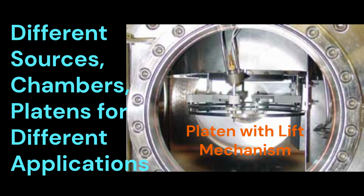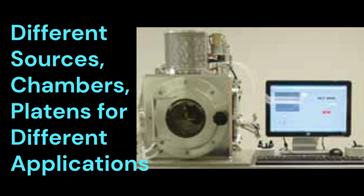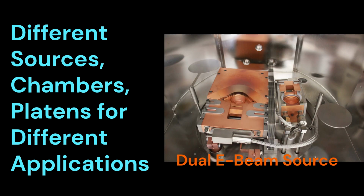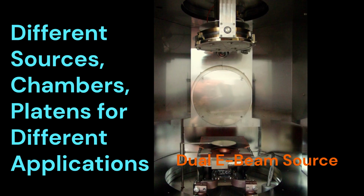Features: electro-polished 14-inch cubical or 21 inches by 21 inches by 22 inches 304 LSS chamber. 5x10^-7 torr base pressure attained with turbomolecular pumping package. 4x15 cubic centimeters pocket gun. Source and substrate shutters. 6 kilowatts and 10 kilowatts switching power supply. Automatic pocket indexing. Programmable sweep controller. 26-inch by 44-inch footprint with SS panels for Class 100 cleanrooms. Quartz crystal thickness sensor. Substrate rotation. LabVIEW user interface. Emergency-off protection and safety interlocks.